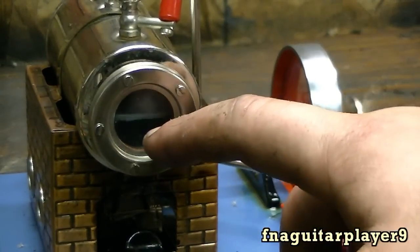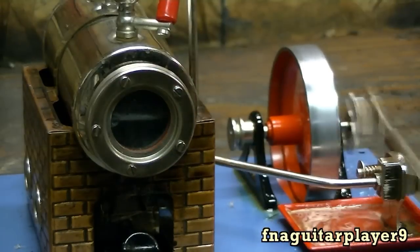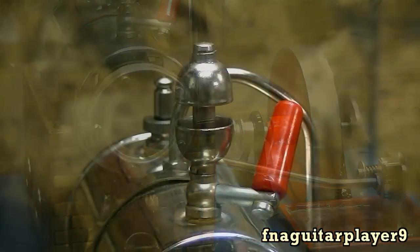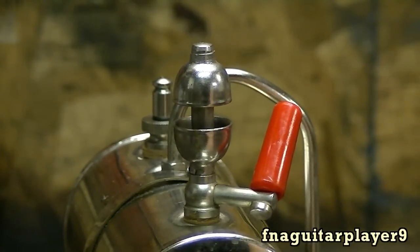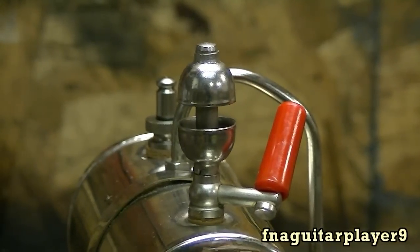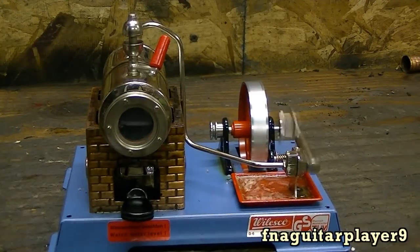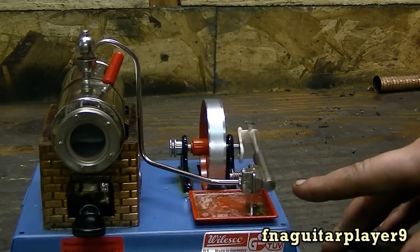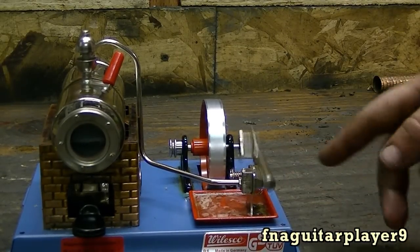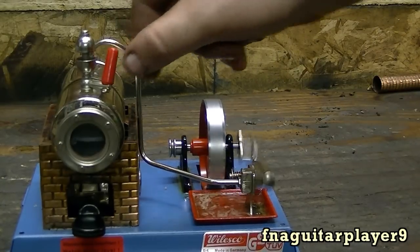Keep an eye on your water level and don't let it drop below the glass. I like to run it until it's a quarter way out — that's usually when I shut it off. I don't recommend trying to put more water in it when it's hot. Let it cool down first, then you can open it, because you can very easily get burned. The book says don't run it any longer than 10 minutes without re-oiling everything. If you have to re-oil it, you'll have steam coming out, so always release the pressure first.